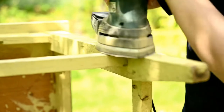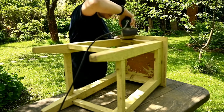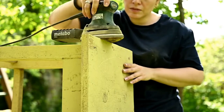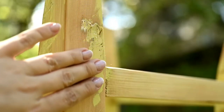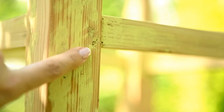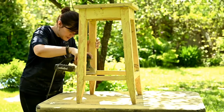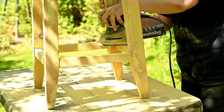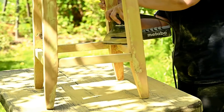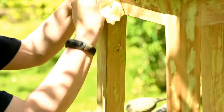Next I'm going to work with the stool. First I'll give it a good sand. I had the idea to strip the paint down to the wood and stain it to make the wood texture visible, but I abandoned this idea quickly. There are lots of damaged areas on the stool legs and the surface is very uneven — dents filled with paint — so it would be too hard to clean all the paint out. I've decided I'll just paint it, so I'm making the surface smoother and removing old paint streaks.